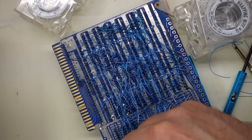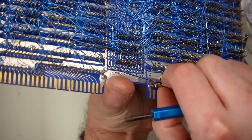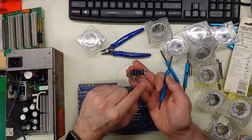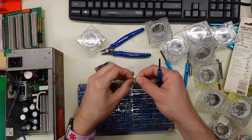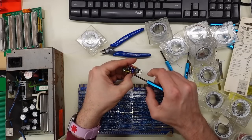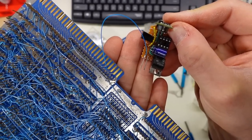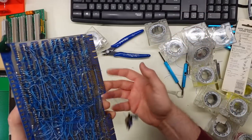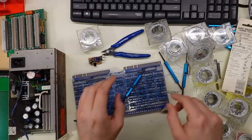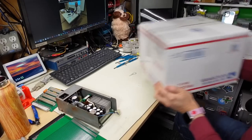I'm going to try to wrap a piece of wire on here. That is really cool — I just wrapped the wire on there. I know I'm sounding giddy for something that isn't that big a deal, but I think it's pretty awesome. You can wire wrap onto any type of square pin. I strip some more wire, feed it into the tool, feed it onto the pin, hold the wire and twist — and there's a close-up of that wrapped connection on that one pin. There's a bit of an art to this and you probably get really good really fast. Thank you Seth — that's really cool.